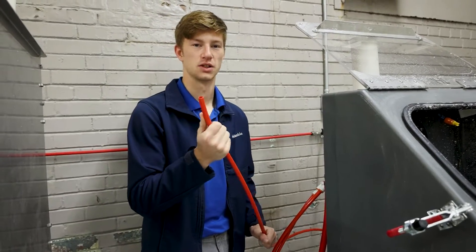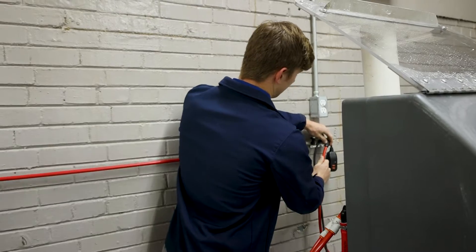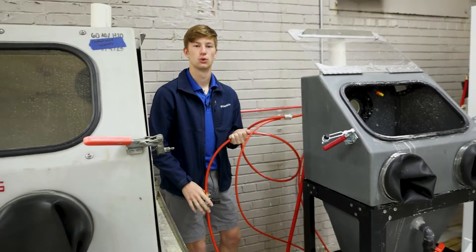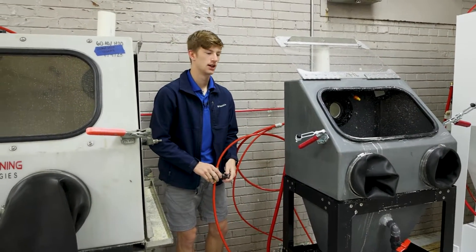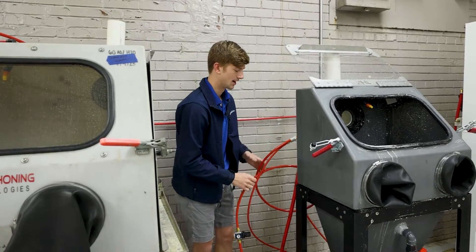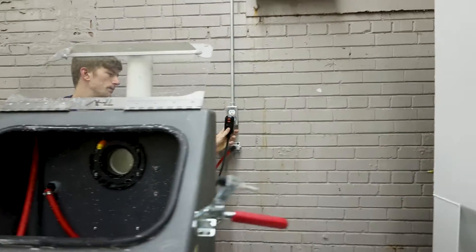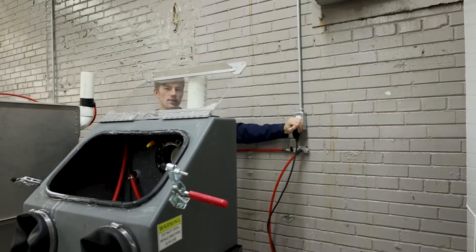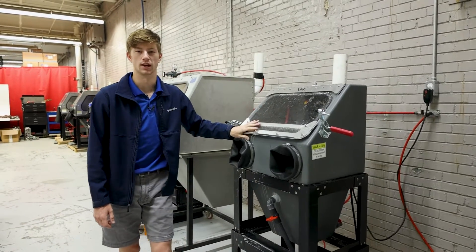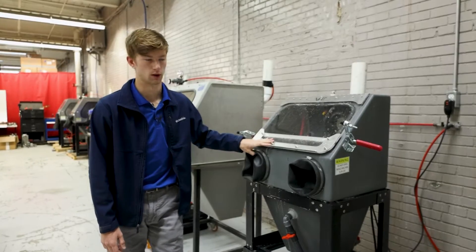For this machine we're going to use a push-to-connect fitting — it's as simple as just pushing it in, and just like that you're connected. We do have a regulator in line here. You're going to want to keep that between 60 and 100 psi for all our machines. You can push higher on something like an HD, but for our standard lineup 60 to 100 psi is where you want to be blasting. You can go ahead and plug the machine in — for the standard machine it's 60 Hz at 120 volts. Each machine on our website will specify the power requirements, and if you have an immersion heater it's going to be 220 volts.